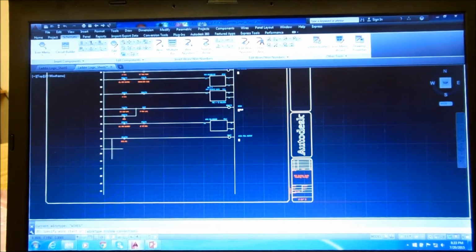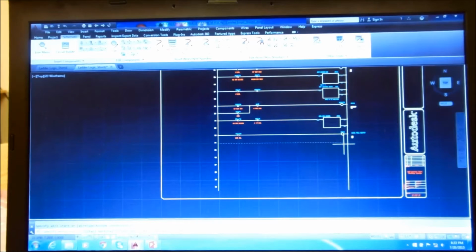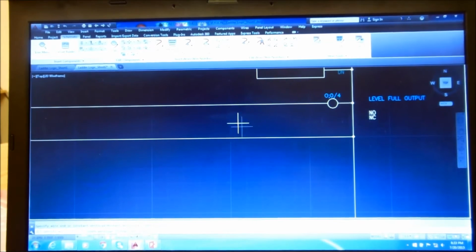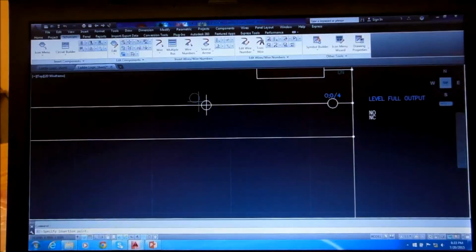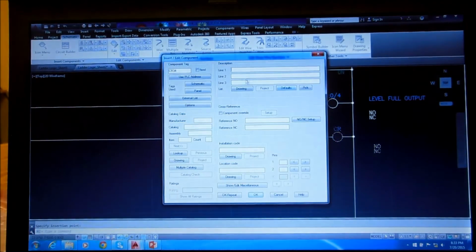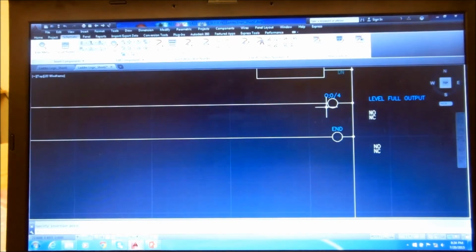We probably want to put one last wire in there, from there across to there, and then we want to put one last icon in there for our end rung comment. And we'll just call it end, give it no description. And now here we're out of line a little bit. What we can do once again is we can just do our scoot. And there we go.